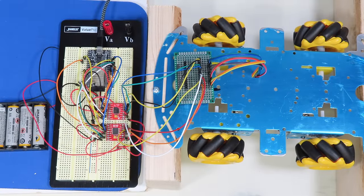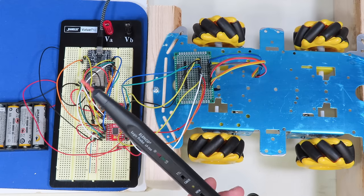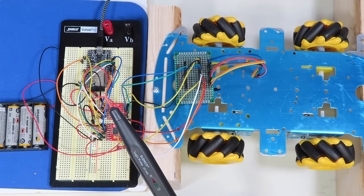I'm ready to begin testing all of our motors. One handy thing I found when developing this was a logic probe — I actually did have a wiring issue that I was able to troubleshoot quite quickly with one. Probably even quicker than I could have used an oscilloscope. It's a very handy thing to have around; it'll tell you whether the level is a zero or a one, or whether it's pulsing, and they're very inexpensive.